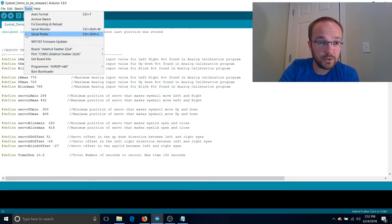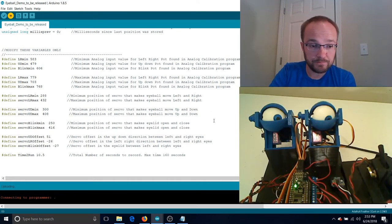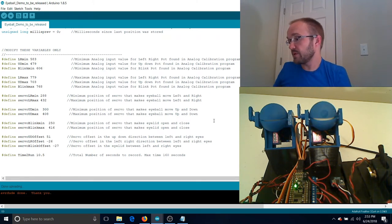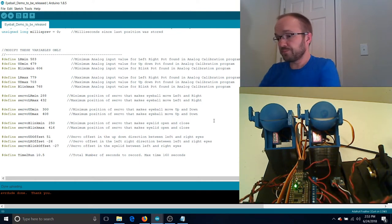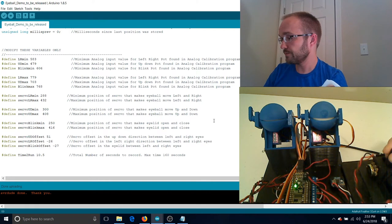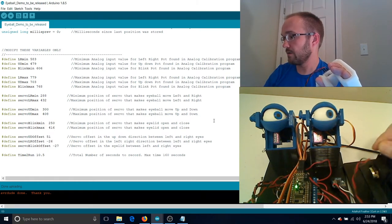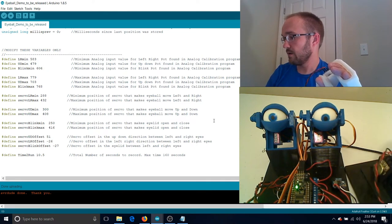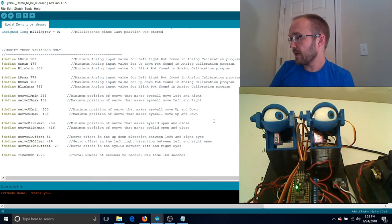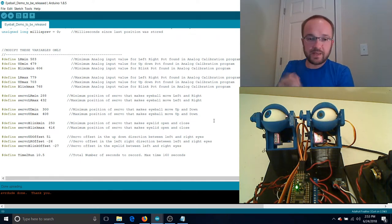Make sure we're still on COM3 and hit Upload. A strong reminder to make sure your power supply is hooked up first. Once uploaded, press the green button. When that green light turns on, you can start recording. Move the joystick: open, left, right, up, down, around. The green light turns off and now it plays back exactly what you did. There you go, guys — you've completed the animatronic eyeball project.